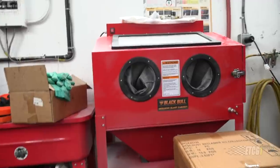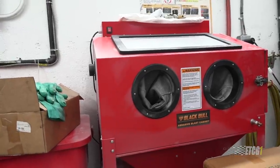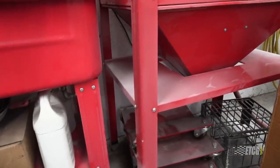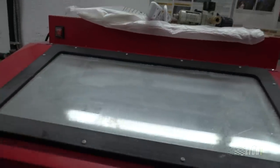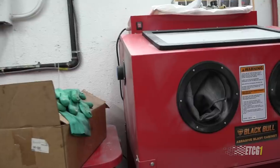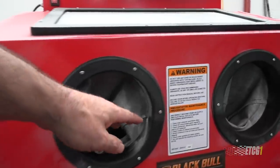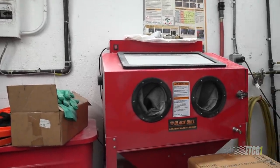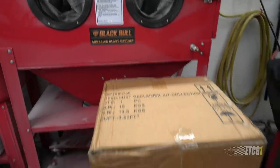This is the one that sparked the video, and it's the most recent thing I've experienced. I've had this sandblast cabinet, and I haven't done any reviews on it yet because I wanted to use it for a bit first. You probably noticed there's a lot of stuff around the outside — you need to hook something up to help eliminate the dust, because when you're looking through this thing, you can hardly see anything as you're working. I tried to hook my shop vac up to the side, but the problem is it's too powerful — it sucks the gloves right out of the holes, which defeats the purpose. So I wanted to purchase a solution, which is a dust reclaimer, and this just recently arrived.